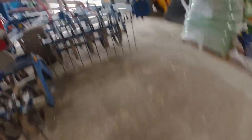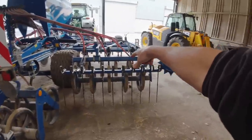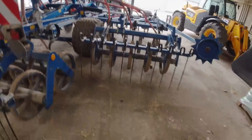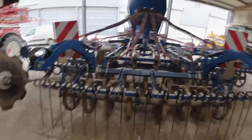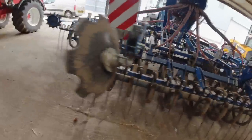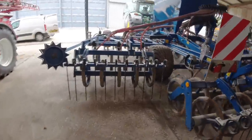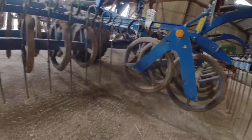I've got drill spouts and drill coulters to make sure they're properly in line and where they're supposed to be, because we noticed during the spring drilling that some weren't quite spaced properly. So I'll go through and check all of them. I'm pretty sure that every drill coulter is supposed to be in line with one of the rings on this press.